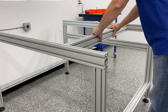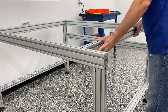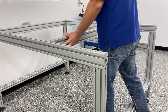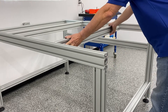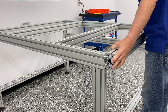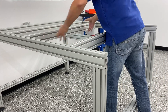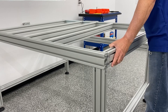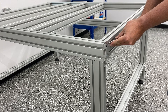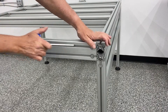Here I am sliding the cross members on which connect the left side to the right side of the table. This is a 48 by 48 inch machine and there are five of them that go on. You're going to see me use a piece of dimensional lumber cut at a specific length and clamped in between the aluminum extrusion to get it to a perfect measurement. If you plan on using the Avid spoilboard for your machine, you're going to want to use that dimensional lumber and clamp it in place — it actually puts everything exactly where it needs to be. Once you get your front one in, go ahead and tighten it — that's your starting point for the rest of them down the length of your machine.